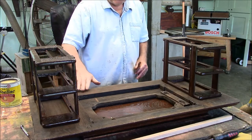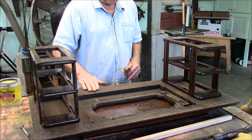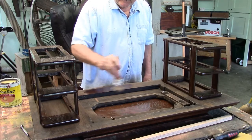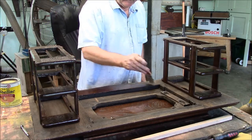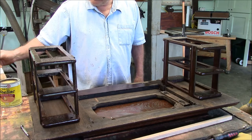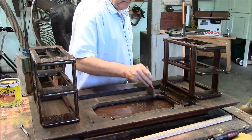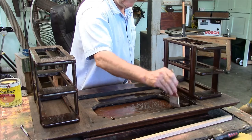I probably remember when I finished this work surface — I just left the bottom of the work surface untouched, but I said I might put some shellac or varnish on it. What I'm doing here is putting shellac on it. Now, the deal with shellac is it makes a real good finish and it dries super quick. They say you can put a second coat on in about 30 minutes. It's real nice stuff to work with, but it's not as durable as varnish.